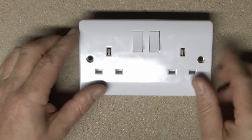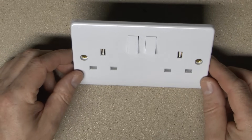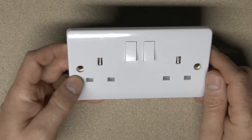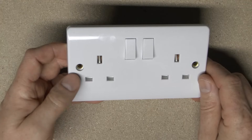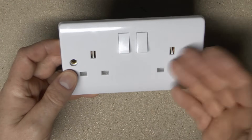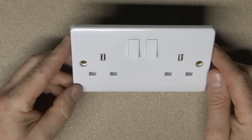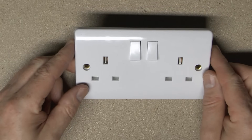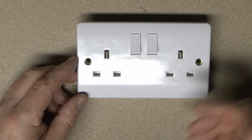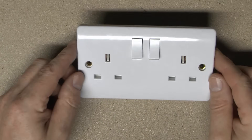In the real world it could be 10 in each or something. It's about the heating effect of the current going through the various parts of the socket, the plug, and the conductors attached to the rear. Now, what about the situation in the kitchen? This comes up quite often where you've got, say, a washing machine and a dishwasher and you want to plug them both into the same outlet, because they're quite often located next to each other, typically either side of the sink. Most modern dishwashers — made in the last 20 years — only have 1800 to 2000 watt heating elements in them. Even when the heating element's on you're only looking at around 10 amps or so for each, so even if they were both heating at the same time that's two lots of 10 amps making 20, which is the actual test used for these.